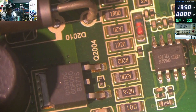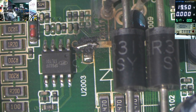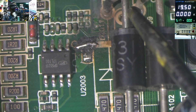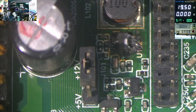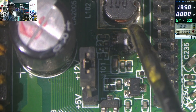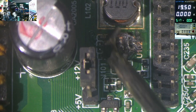We check exactly the problem of this motherboard. Something is not right here — there is a missing component next to this chip. We have those components in parallel mode, and here we have another blown-up chip. If I do remember, this is the 5-volt power supply for the standby, and the driver is gone. So that is the problem with this motherboard.